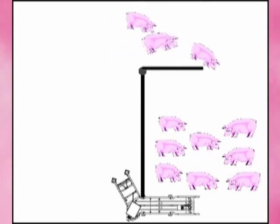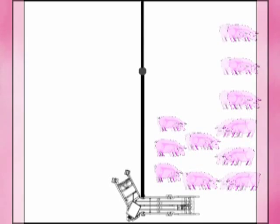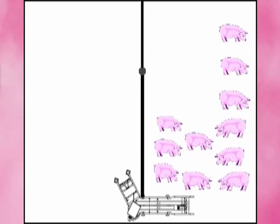Reset the pen dividing gates to the starting position just after the next feed start time. This start time is the beginning of the next 24-hour feed cycle. This is usually set right before the end of the workday.